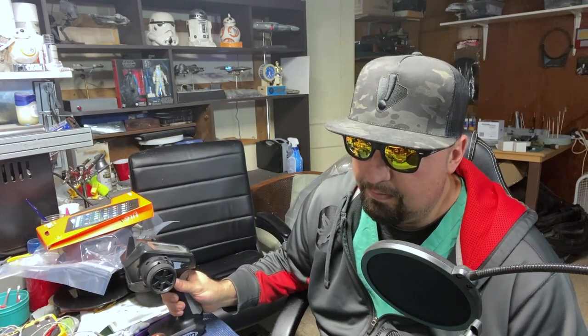I want you to listen to this. I've got the microphone going right here, I'm going to pull the trigger and you're going to hear the motor increase in stages — I'm just going to pull all the way to 100% throttle. So listen. There are only three stages audible in there right now because I haven't got the fifth stage firmware uploaded, but you heard it go — that's basically more throttle being put in.